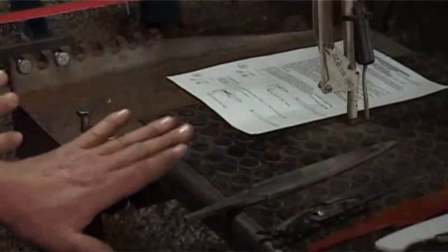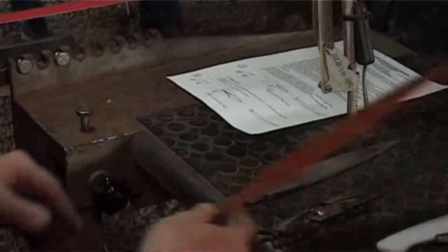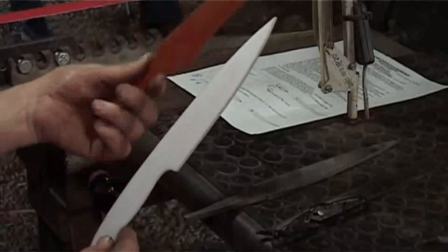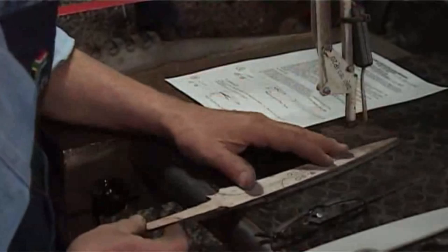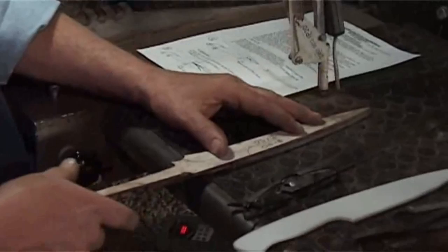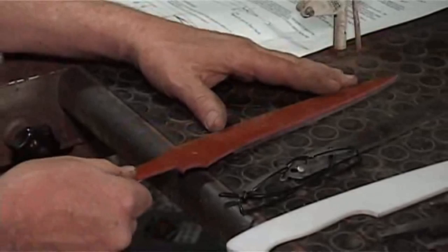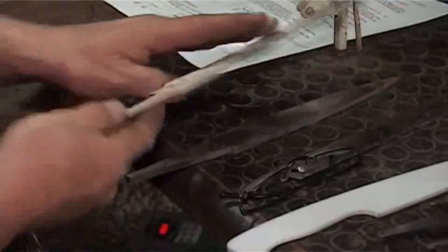So the trick that I have, well, it's not a trick, is to take templates, and I've taken these ones that I have here specifically. You see that? A chef knife and a kind of asymmetrical sticking knife of some sort. Is the camera getting all of this very nicely on the screen? I'm hoping so. If I must change my angle, you must let me know. You will use one side of your template like that and flip it over to the other side like that. You with me? So using the exact same profile for both sides.